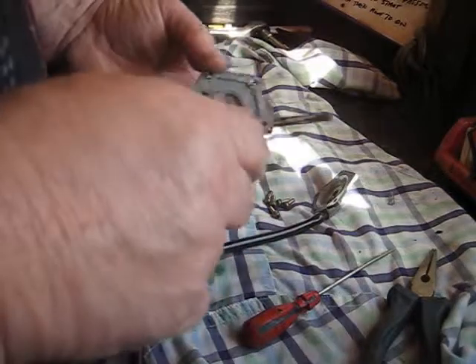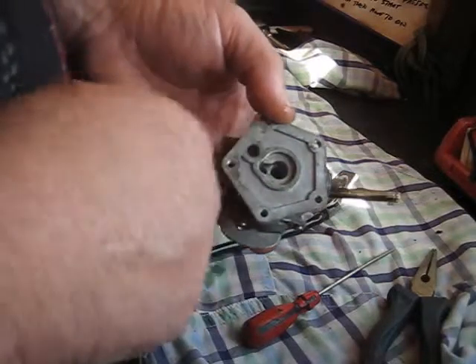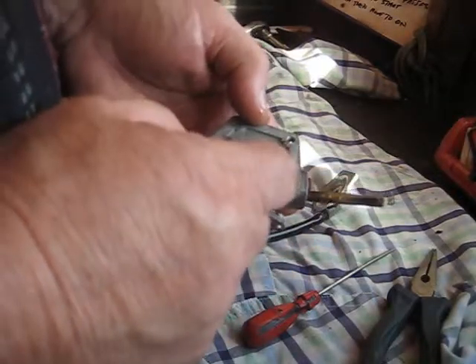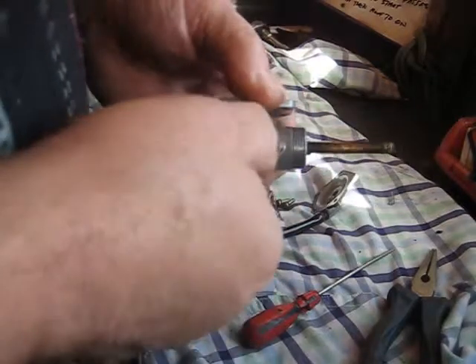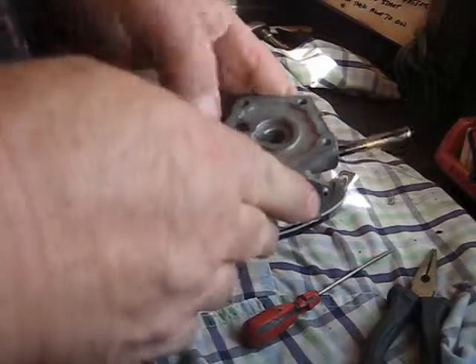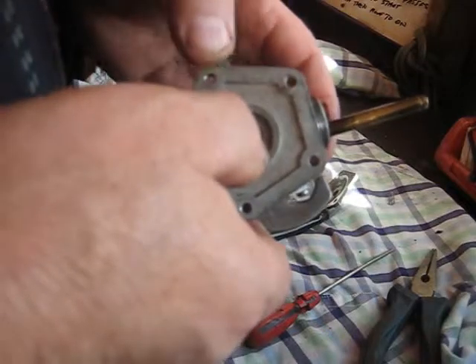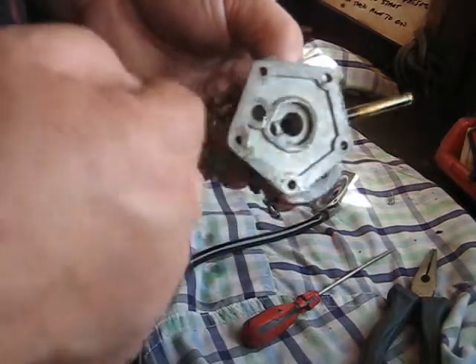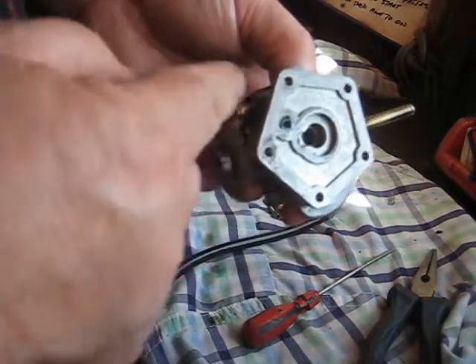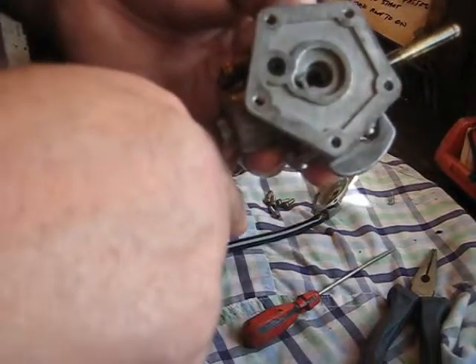This is blanked off by this diaphragm. This diaphragm only lets fuel through when the engine's running. So to start it — because if fuel can't get through when it's not running, it can't start — what you have to do is put the tap into the prime position. When the tap is in the prime position, fuel goes down the reserve hole, which is this one, bypasses this completely, bypasses this shutoff diaphragm and comes out via the fuel bolt at the bottom. So in the prime position, fuel goes straight through. Now if you leave it in that position, there's no off — it doesn't switch off.